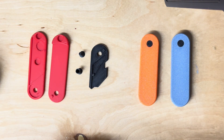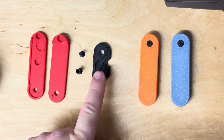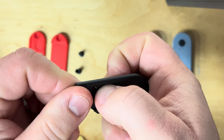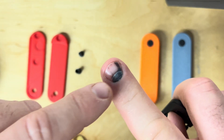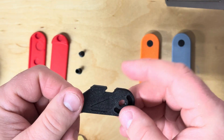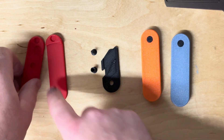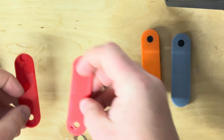To assemble this you're going to need the three black pieces. The piece that really needs to be PETG is this one right here, because there's a kind of spring which holds the knife in. This is very dangerous — I cut myself not that long ago assembling one of these. This part should be in PETG or something with a little springiness, because with PLA it might just bend and not come back. The other pieces I made in PLA, but it could all be PETG or all PLA — you can try either.